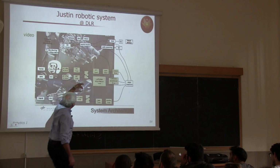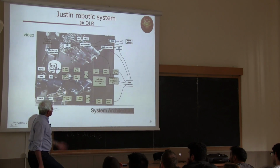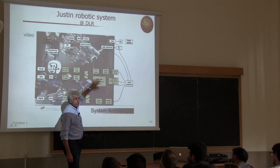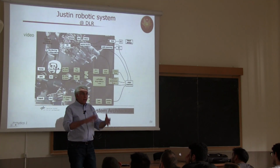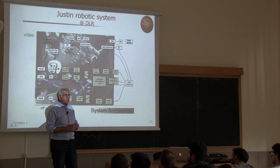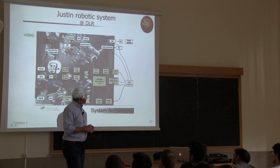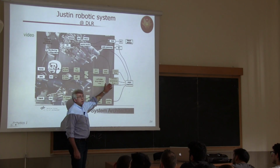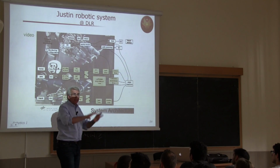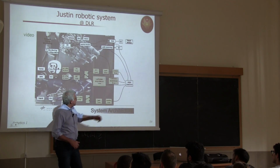And then you can combine this into position control, then you interpolate trajectory, you solve inverse kinematics every 60 milliseconds. While doing this, you can also impose some Cartesian impedance. We have seen some examples in the KUKA lightweight demos where you can use this compliance, so being more stiff or more compliant in different directions. And impedance is a generalization of this concept where you can change the apparent inertia of the system at the Cartesian level. You may have a routine which provides collision avoidance in real time. They run at 3 milliseconds. And all these components and software pieces are coordinated at the discrete level of events by a state machine.